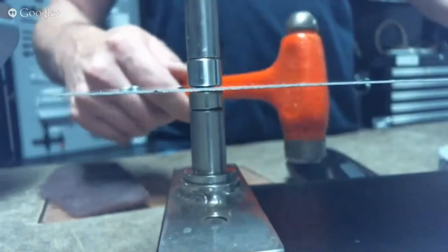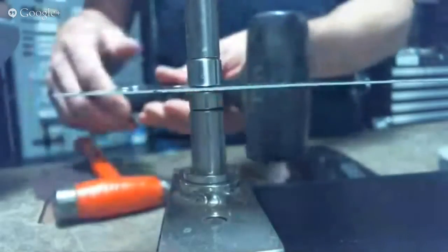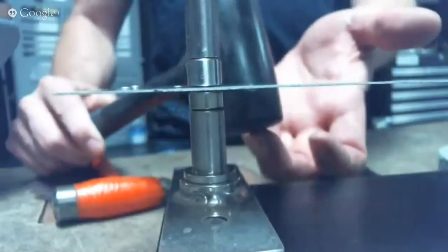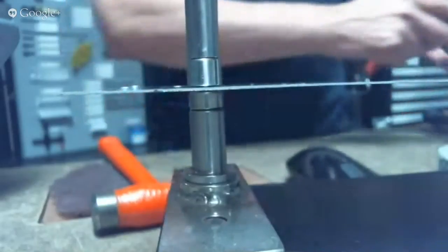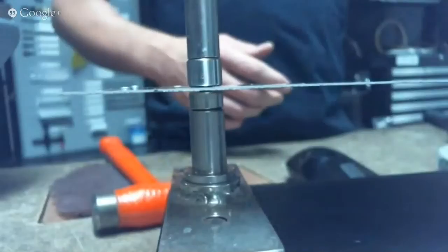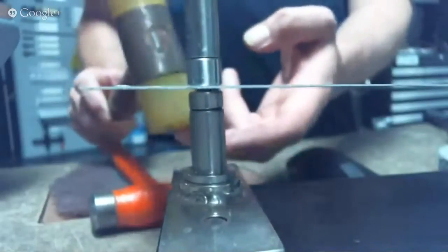This is an eight-ounce dead-blow ball-peen hammer. I almost insist that you use a hammer with a hard steel face on it. If you use a dead-blow plastic mallet, some of that force is absorbed in the hammer head itself and you don't get that crisp, sharp force on the end of the RAM that transfers into the aluminum. Some people like to use a heavier hammer and barely move it an inch or so, which is fine — it's just personal preference. We built most of our RV4 with a claw hammer. Here's another example of a soft-faced mallet — not only do you not get that sharp force and your dimple is not quite as crisp, but you can't hear quite as well what you're looking for.